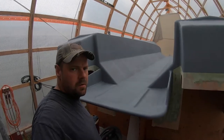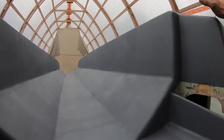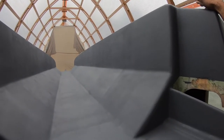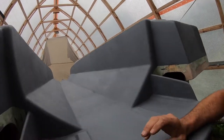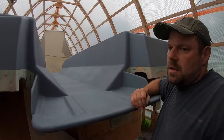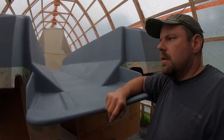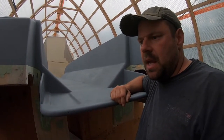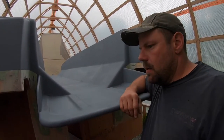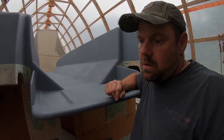The third and final coat of primer is on. Everything that's going to get painted white — the tunnel — will have to be sanded to 320 grit. Everything from the waterline up we're not going to paint right now; I'll sand it to about 180 grit. We're looking into different options for bottom paint. We originally decided on standard black anti-foul paint for the hull and I ordered everything from Jamestown Distributors, but doing more research I really don't want to be repainting this every year. We've been looking at a silicone-based paint — the company in Europe is called Silicone and they offer a colored silicone-based paint.